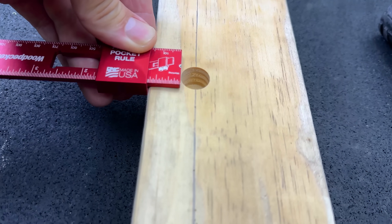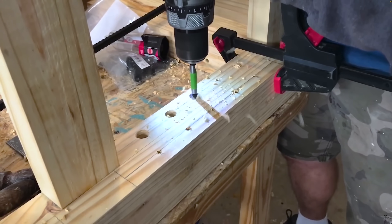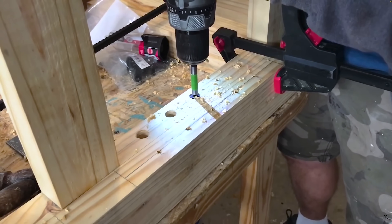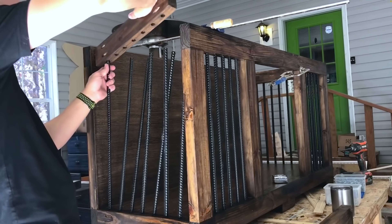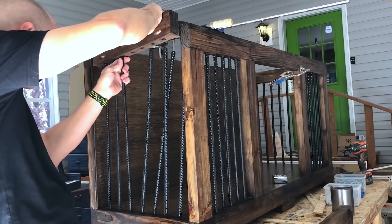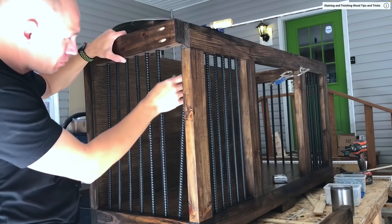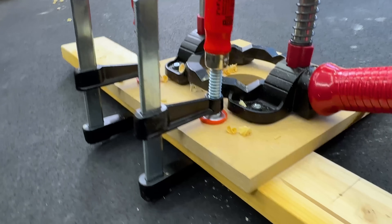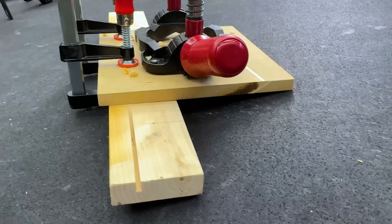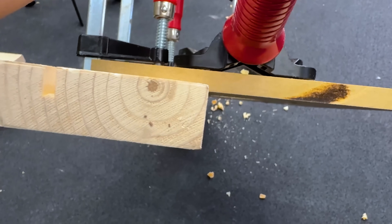Where this is specifically handy — I remember when I was first starting out building a dog kennel, I needed to inset some rebar in the boards, basically making a cage for the dog. I needed to put those a certain distance apart and wanted them all to be uniform. I did it by hand and the holes were off angle. This is going to drill a perfect 90-degree hole consistently from the edge of the board — it'll make your work look better, more consistent, and easier than doing it by hand. If you have a project you're working on, you can build any size base out of scrap plywood and use a scrap board as a fence, then set distances just like that.